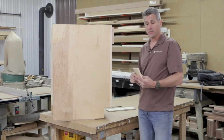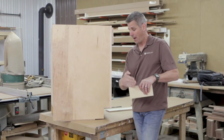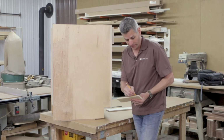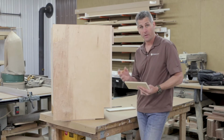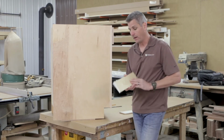What you're going to use is the same white, or whatever color your job is, material. You're going to walk over to your chop saw, and you're going to cut a back angle. So if this is the face of it, and I'm trying to finish off this left edge, I'm going to miter it off like that. Okay, and then all I do is cut off of another piece of scrap toe kick material. I cut a corresponding angled piece to cap the end the way this is shown.